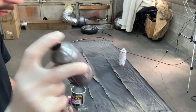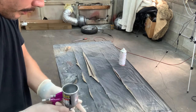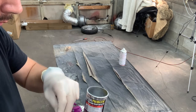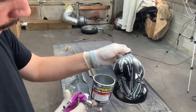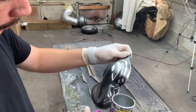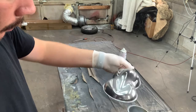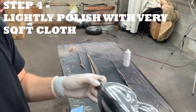Our next application is the HVLP touch-up gun. You're going to want to use a fairly small nozzle — I think I have a .6 or .8. It's just the cheapo Harbor Freight central pneumatic gun. I've got quite a bit more paint coming out and quite a bit of air as well. You want the coating to really atomize, meaning you want the particles to come out very, very fine. Use a good amount of air and regulate your paint based on that. You end up with a very, very nice shine.